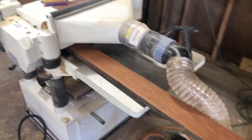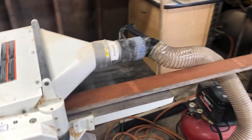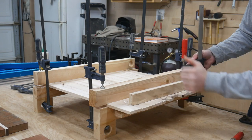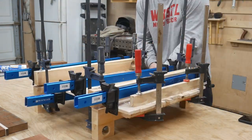So in the interim, I actually acquired a ton of this really nice — I think it's Brazilian cherry wood — like a really nice tropical hardwood. It's red in color, so it's perfect for these brick-style cutting boards. What you're going to see next is just a series of me doing pretty much the exact same steps that I did before to get to a much nicer project. One thing I did different is I borrowed my buddy's 20-inch helical head planer, which made a huge difference in being properly calibrated and cutting down that hardwood. My 13-inch lunchbox planer could barely handle it because of how dense the wood was. I understand not everybody has access to that kind of tool, but I did plan this second go-around knowing I would have access to it.